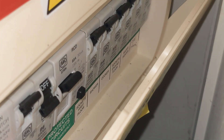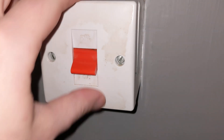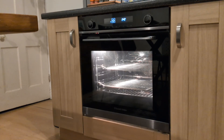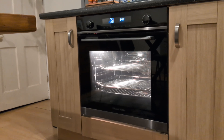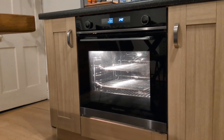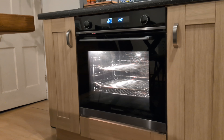You can then flip the switch on the breaker panel to feed power back to the oven, and if you have a kitchen switch you can turn that back on, then turn the oven on to see if it works. New ovens do need to be turned on high for an extended period before you cook in them, to burn off chemical residues on the shelves, walls, etc. Put it on high — about 240 degrees — for about one to two hours, once or twice the day before you cook.